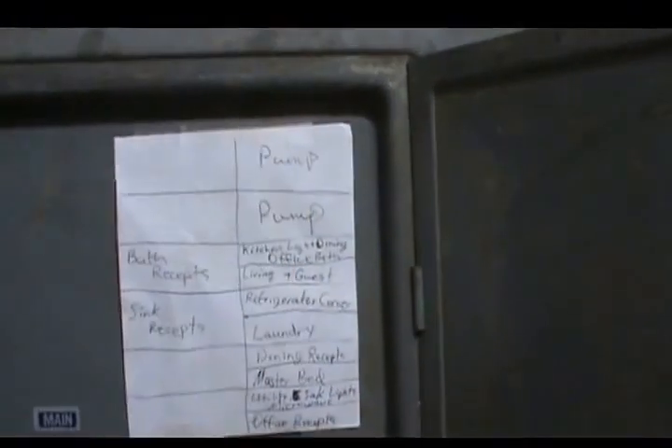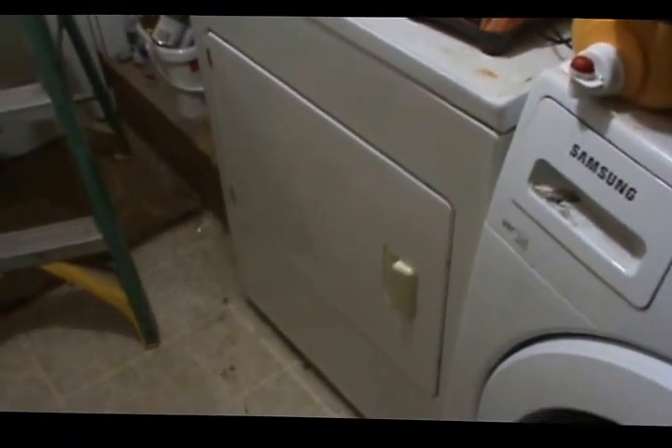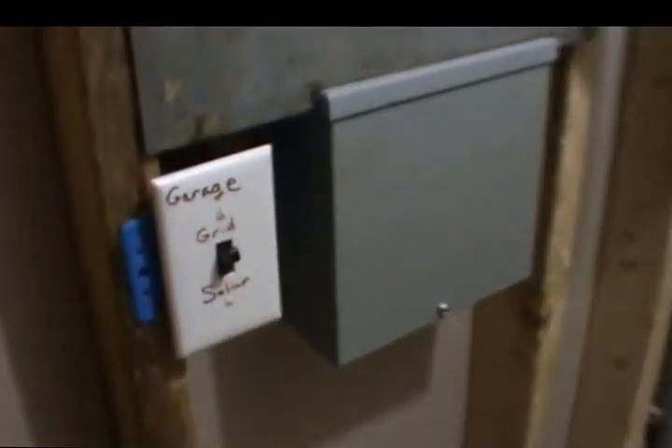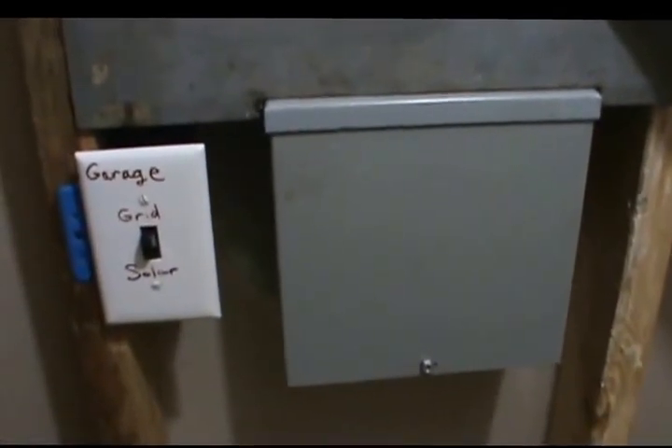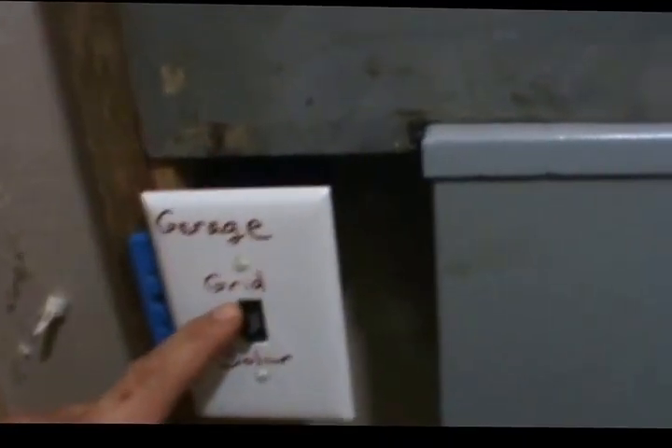With this system we're able to power just about everything in this small house, including a 200-foot well pump — leaving out the dryer, as that would be silly, and the water heater, which I explained my plans for in a previous video. In the summer it powers a couple of these little window units that handle most of the cooling. The central air can be powered either way through a transfer switch from my previous video, because the central air outdoor unit is powered from the garage panel, and I have a switch to decide what to power the garage from.